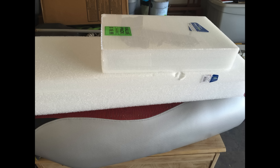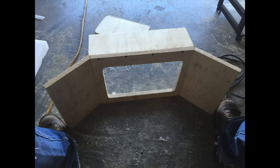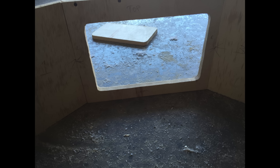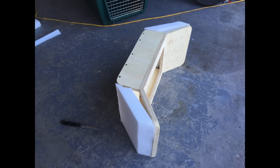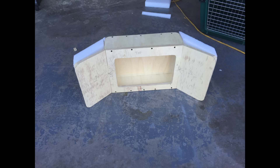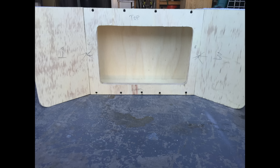So like I said, I really didn't have a plan. I picked up some plywood and some styrofoam, and then I just started measuring and building off of the actual template to mount the chart plotter. Cut the hole out, got a little bit of room on either side of it, tapered the wings, put them at a 45, used that styrofoam for filler, started to shape it using a steak knife - slowly cutting it and getting it to the form I wanted. Then I started to reinforce it with some fiberglass and resin.